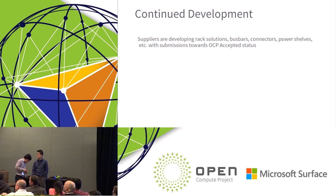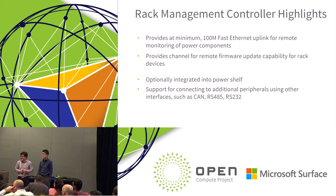Sorry, I'm from Nokia, so I can comment a little bit about that area. I'm happy to see that how it is currently specified keeps doors open to specify also the minus 48 volt option. The voltage range is exactly what we are using in telco space, only the polarity changes. And as you mentioned, the point of load converters, we can use the same coils in both cases, so I can see clear benefit in there.